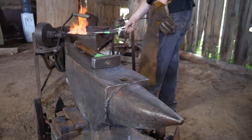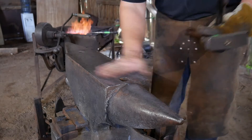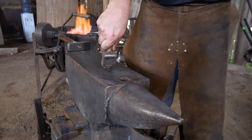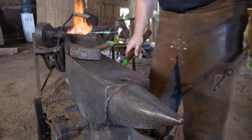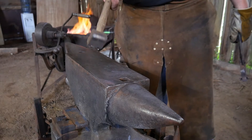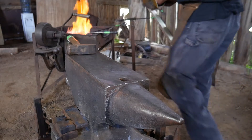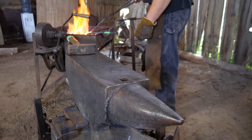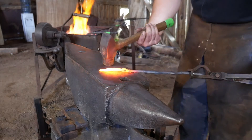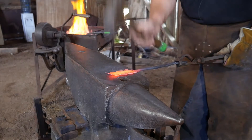Let's take one more light heat - a nice bright orange color. We're going to switch cross peens. I'm switching to a cross peen that has like a 3/8-inch radius fuller to it. This hammer is a bit heavy, but it's within reach and I can use it to create the texture I'm looking for. Got a little bit of scorching on there - caught it just in time. I'm going to straighten it up, and now we're going to come from the top with some overlapping hammer blows to create the texture.